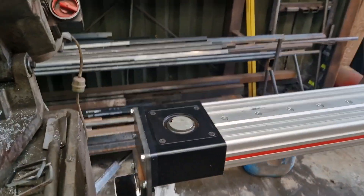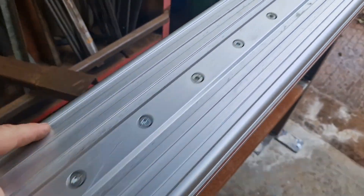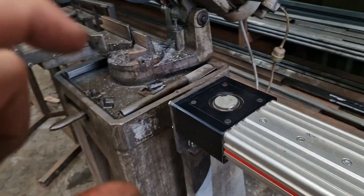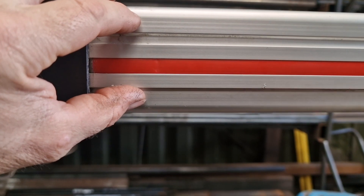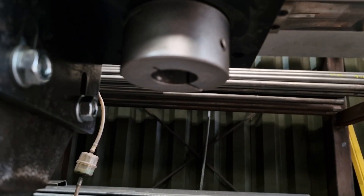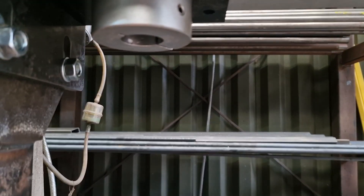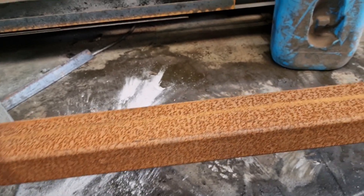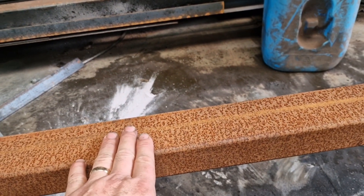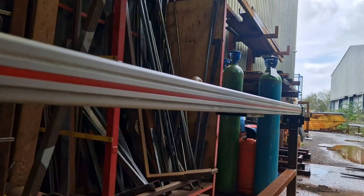Back to this. So what we've got is a big shaft — that is a 50mm shaft in here. All the way down here is a huge belt; you can go all the way back up the other side. That belt is — if you can imagine — 60 to 70mm profile. That belt just fits in there, so it's a hoofing great belt, and a hoofing great motor is going to sit on there. We've got holes in the top here so I'll be able to make a bracket and bolt a closed loop motor on there. This is the plate that's going to have the stop mounted to it — it's quite hard to turn by hand.